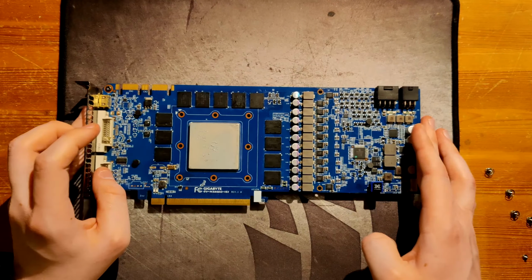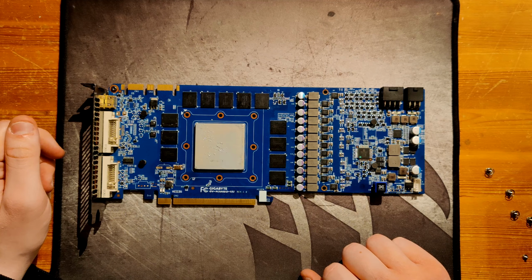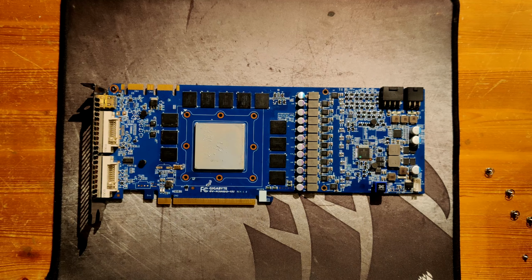They are not these. So the datasheet for the 4921N lists, I think at 25 degrees ambient, which is a bit hotter than my test bench setup, a continuous drain current of 8.8 amps for one of these 4921Ns, with 24 of them used as low sides. If my math is correct, that makes slightly over 210 amps of maximum current capability. That's not a lot. I would think that's actually less than a reference card. And that's why the revision 1.0 of this card is very, very not good in my opinion.